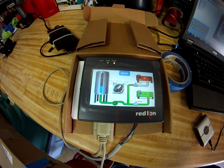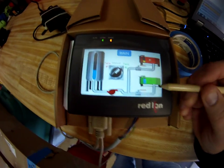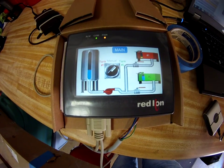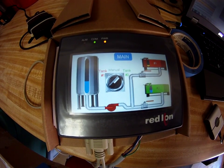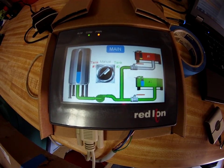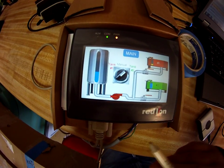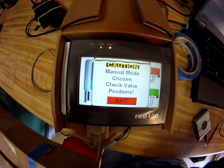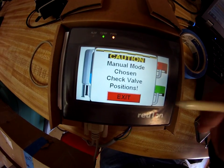As this tank fills up, you'll see the screen shuts off. I've put some little displays in here to show what's happening. If I take the tank down again — I don't see the percentage because this is just a four inch screen so we're limited on real estate. As I go down and drop below the 35 percentile it comes on, and as I come back up it shuts off. Now let's say I want to run this in manual mode. I click here and turn this to manual mode, right in the center.